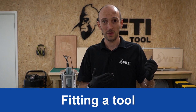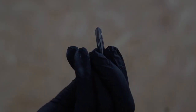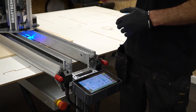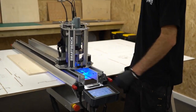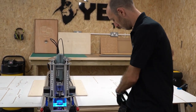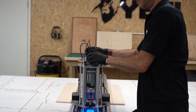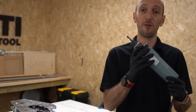Now we've done our work holding, it's time to put the cutter into the spindle. Our first operation is to engrave on the top surface, so we'll be using an engraving bit — specifically a 90 degree V groove bit as called for by our CAD file. We'll move the Z head closer so we can get the spindle out, then take a driver to unclamp the spindle, disconnect the power cable and the data cable, rotate the spindle, and lift it out of the Z head. Now I'm ready to change my tool.